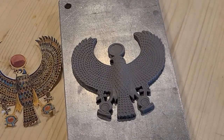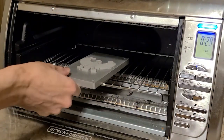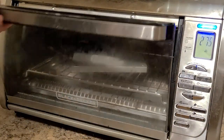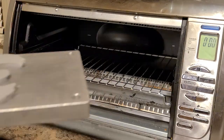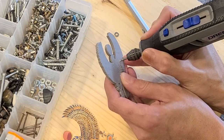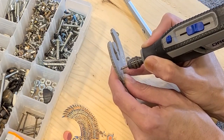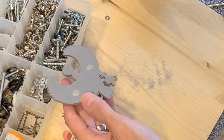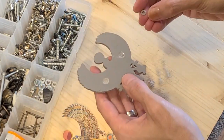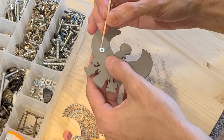A very long while. But eventually — a few minutes later — I needed to put a couple of pieces of steel on the back so it makes it easier to use magnets to remove it from the mold, from the sand. I should have embedded these in the clay while it was soft but I forgot completely about it. Super glue on the fingers!